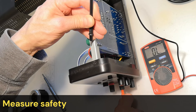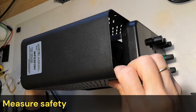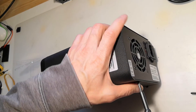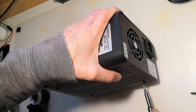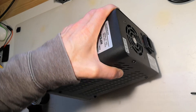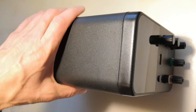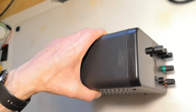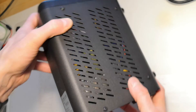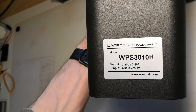Note that the negative wire is not connected to the grounding, but this is typical with switching power supplies. Putting the case back in place, the device is ready for use. With Chinese devices, I want to check the safety by opening the device before use — sometimes the grounding reaches the device's plug but the wiring is not connected forward. But in this device, the grounding was in order. Thanks for watching.